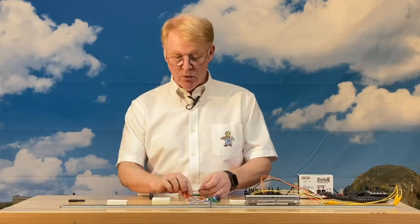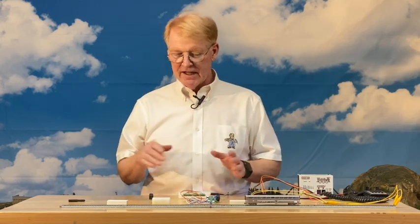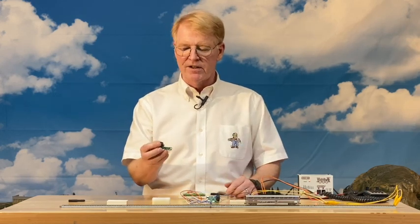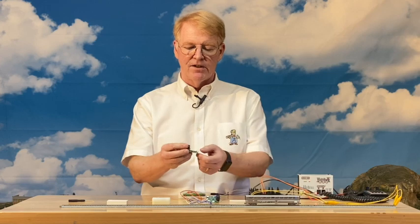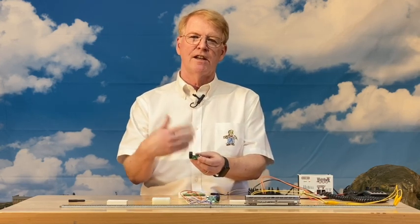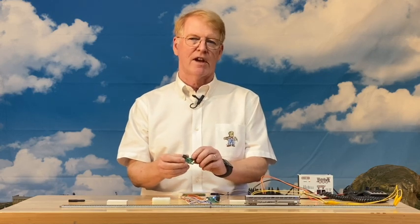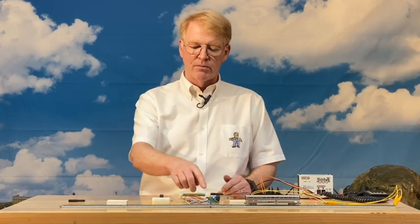These are available now and they're not very expensive. They run off the 12-volt supply and are common to the rest of our ecosystem. There's just one little part we added to complete our detection system. There's a button on here — you can set it in inverse mode so the light is triggered when the train is out of the block, and triggers off when the train is in the block. There are certain cases where you want to do that. There's also a calibration mode where, just in case you have some errant current, you can calibrate this down to zero, which affects the efficiency of the detection.